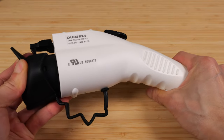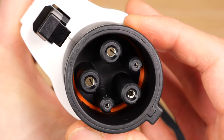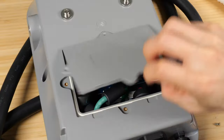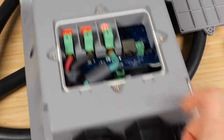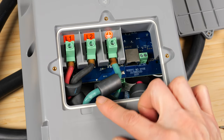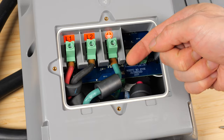It has a grommet to cover the front, and the connector itself looks pretty sturdy. The AC comes in over here and it looks like they're not using the neutrals. They have ferrite beads to minimize noise from going into the device and also going out.